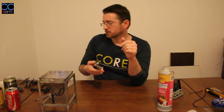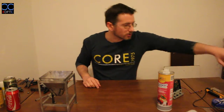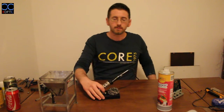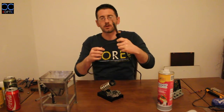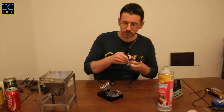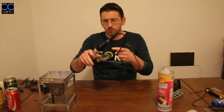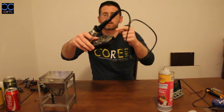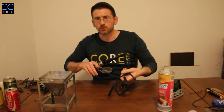You don't really need the hole punch at the beginning — it's just for when you start making holes. The only dedicated tool you'll probably need to buy is a soldering iron. Not everybody has one at home. It's a 60-watt soldering iron — you don't want to go lower than 60 watts; keep it between 60 and 100 watts. That's a good range to work with the metal. You also buy a small sponge — like a dish-cleaning sponge — to clean the solder.